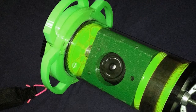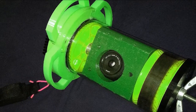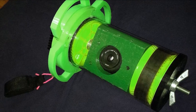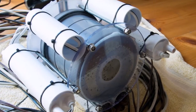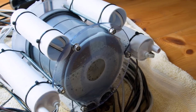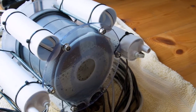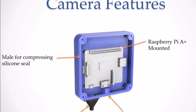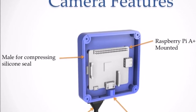The housing has been tested to withstand four bars of pressure without leaking and can be positioned underwater to capture time-lapse images. Fred, the designer, would like to add an Arduino in the future to provide more control over battery usage and provide vital signs to the Pi, as well as adding an LDR to determine whether there's enough light to warrant turning the Pi on to take pictures at five-minute intervals.